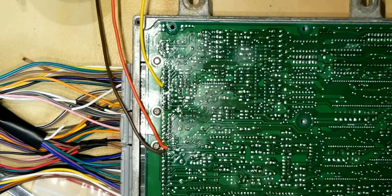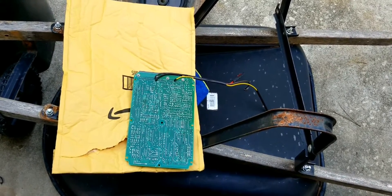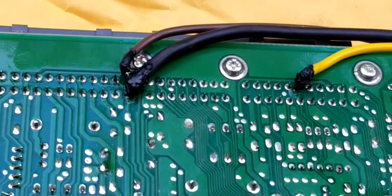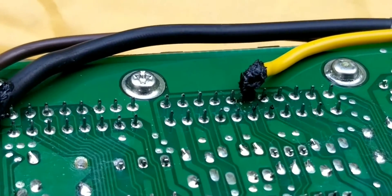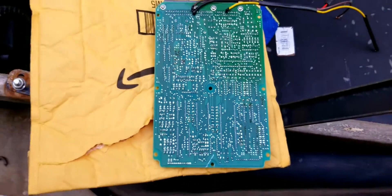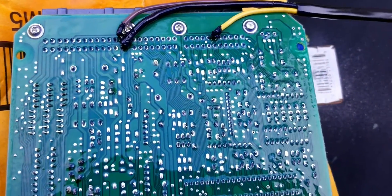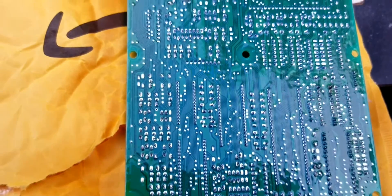So we'll get everything closed up. Alright, we're getting the board ready to spray it with a conformal coating so everything's electrically isolated. People have been giving me flack about the way that I ran this, but I don't think there's a problem because everything's off the pin board — nothing's touching, nothing will be rubbing, fits in the case perfectly. We'll spray this with some conformal coating, get the back all shiny again. I gave it a couple nice blasts — put a nice thick coating on there to keep the circuit board free of any contacts and prevent flexing and cracking of solder.